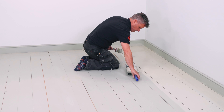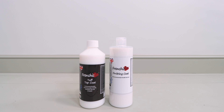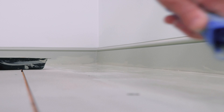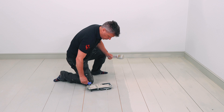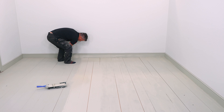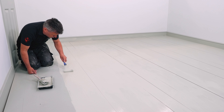If your floor is expecting very high traffic, you can choose to apply two coats of either tough top coat, which gives you a matte finish, or finishing coat, which is a satin finish, as a layer of extra protection if desired. For perfect coverage, a minimum of two coats are recommended at the rate stated on the tin. Once painted, do not walk on the area for four hours, then only with socks for the next seven days. Try to keep your pets off the area to avoid damage, and continue to treat the area gently for the next three weeks until it's fully cured. We'd also advise you do not allow painted areas to become wet for at least a week.